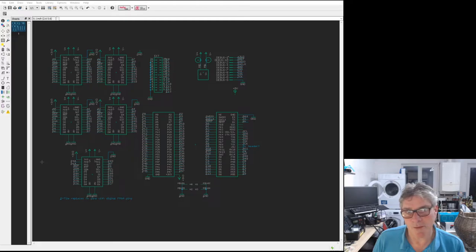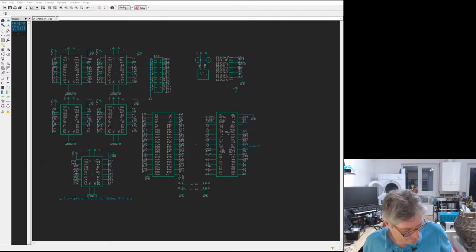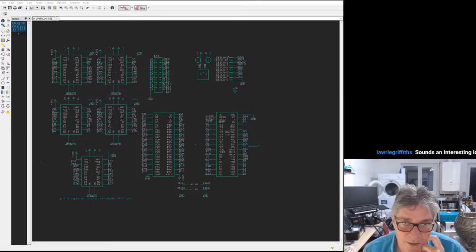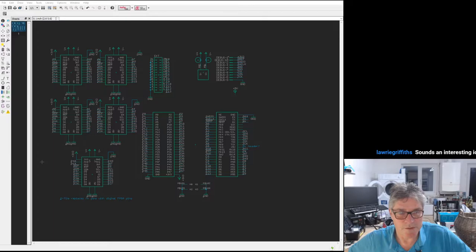Although I'd be worried about memory bandwidth, possibly. So you'd have local SRAM that's very fast. Then you have the secondary DDR2 RAM that you access over the FMC bus through the FPGA. Could you fit the MMU in there somewhere? I'm not so hot on that stuff to know whether that would actually be feasible.